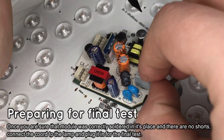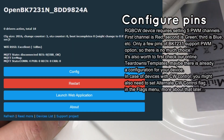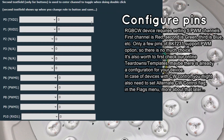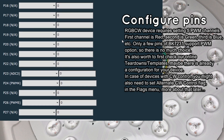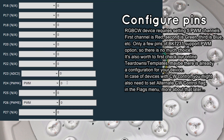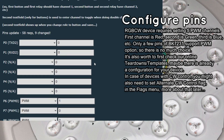Connect the power so you can run the device. Now you should set the IO configuration for your device. You can do it in the OpenBeken web panel — go to Options > Configure Device. Set the 5 PWM pins required for the RGB and CW channels. If you don't know which PWM is which channel, try checking each role one by one.